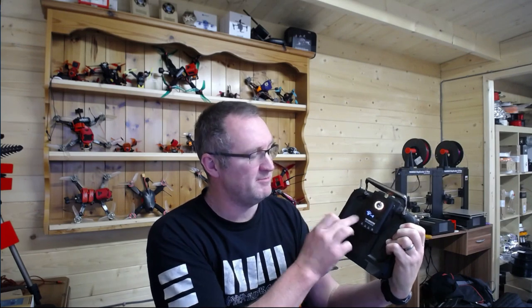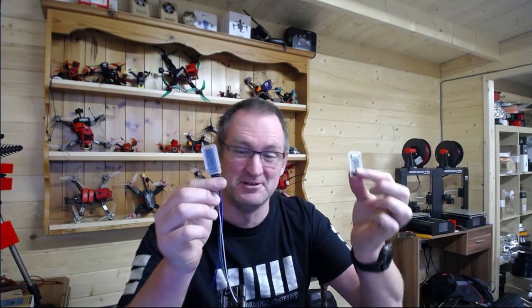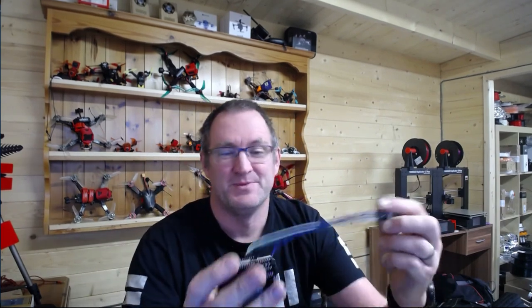The first thing we're going to have to do is program our little module to talk to our crossfire. I'm going to pop the radio on - lovely, Jumper starting up - and we have the module up which means we have a Bluetooth connection. I've got a little Arduino setup over here with another HC-05 module already plugged in. I've connected five volts to five volts, ground to ground, 3.3 volts through to the EN pin, and TX on the Arduino through to TX, and RX to RX.